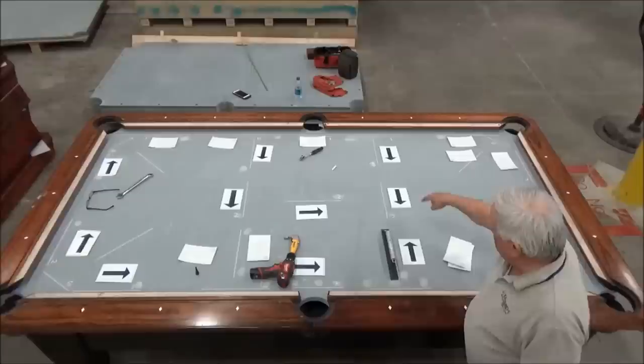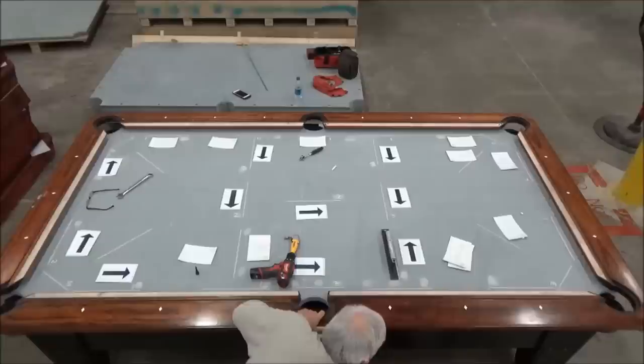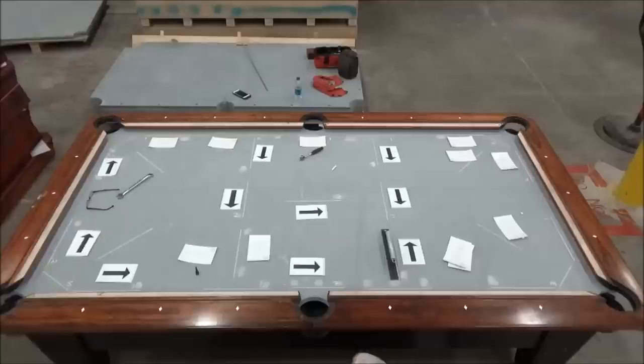So when I adjust the middles, all of it comes up a little bit. That's why I want to start in the lowest spot. Putting pressure there will make those other measurements slightly better. It won't fix them completely probably, but it'll probably make them to where all I need to do is just raise them up until they're touching the slate.